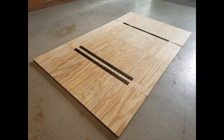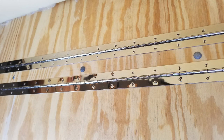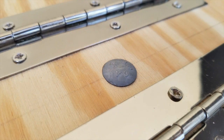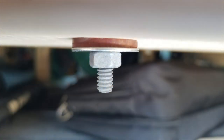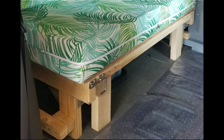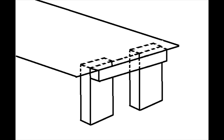Place your platform on the frame and hopefully those hinge points are hitting your supports exactly as planned. To secure the platform to the bed frame, on the 3-inch strip sitting right over the two-by-six on the frame, drill a couple of holes and install bolts — I used three big hefty bolts that go all the way through the platform and frame, secured at the bottom with a rubber washer, a metal washer, and a nut. For front support, especially in bed mode, screw a strip of two-by-two to the underside of the front of the platform, then take a couple of two-by-fours and screw those in place right behind the two-by-two.